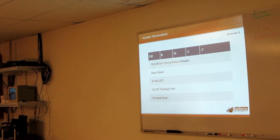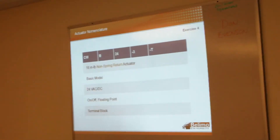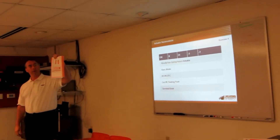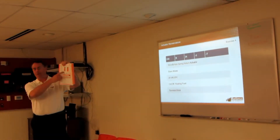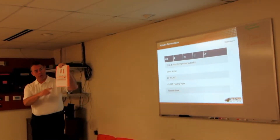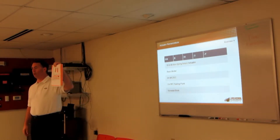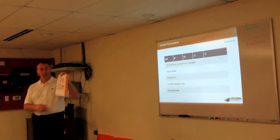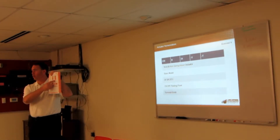You can actually get a heater built onto it too. Page 1-4. I'll hold it up here so you can see the two actuators look a little bit different. The one on your left is a NEMA 2. The one with the enclosure on the bottom, that's NEMA 4 right out of the box, so you wouldn't need any other type of enclosure. You just order it with that N4 at the end — this is what it will look like.